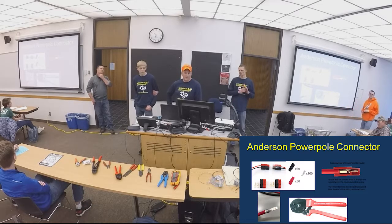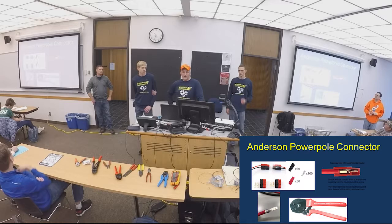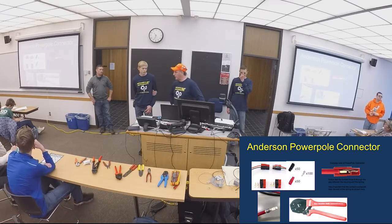As a CSA, I have seen these melt. They draw a current on that drivetrain, and if there's a loose connection inside there sitting there arcing all during the match, it melted these connectors down. So just be aware of that. Don't be scared to use them, but practice it.